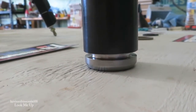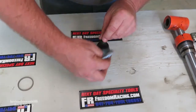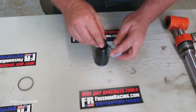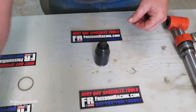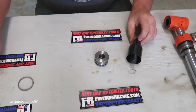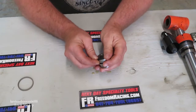When we lay that down on there, we want it to be lined up just perfect — where it's going to drop off right into place. We're going to get a good bit of hydraulic fluid and rub it all over this thing because it's got to be slippery. If it's not slippery, it's not going to go down on there. A little too much is better than not enough. Now we're going to get our ring. First thing we want to do is make sure we put the O-ring in — if we forget that, we're going to be in bad shape. We're going to throw a little hydraulic oil on it too, the same hydraulic oil that the tractor runs in.